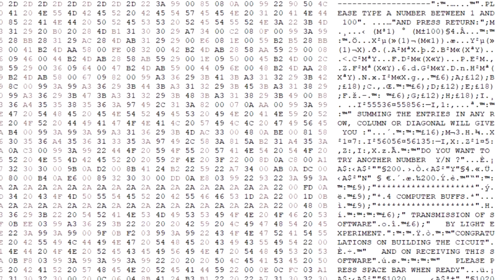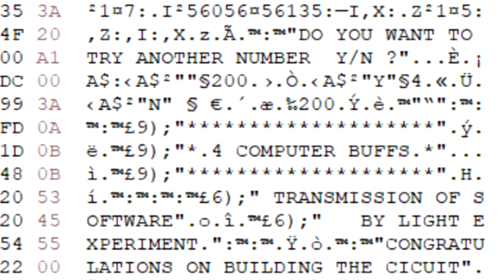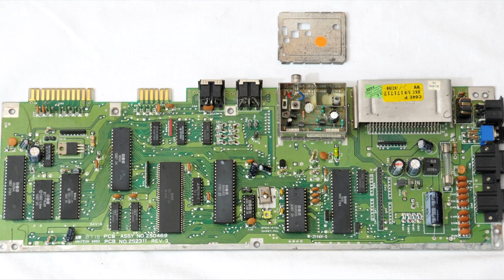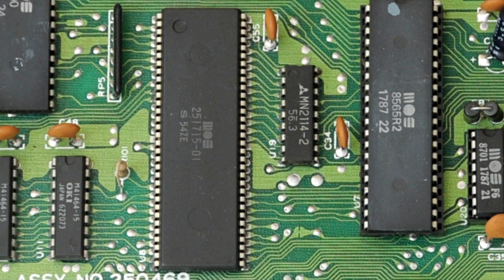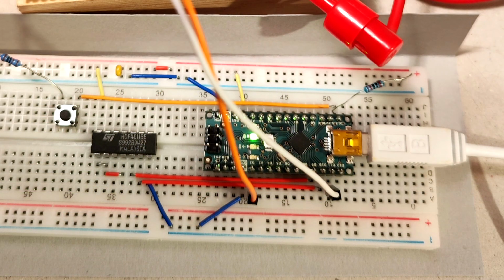decoded. Now, one of the simplest ways to convert this program data into a video transmission would be to use the C64 itself, because the VIC2 chip in the C64 already knows how to generate a good PAL signal. However, putting the program from the past into the C64 first and then receiving it back just does not seem like the right thing to do. We want to have a proper transmission. Therefore, my plan is to generate the video signal using my function generator and an Arduino Nano microcontroller.